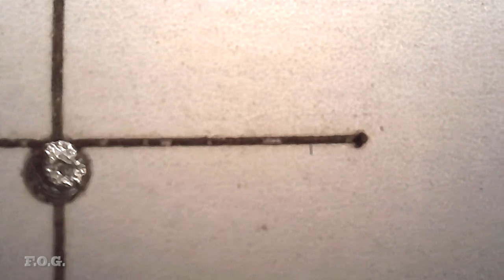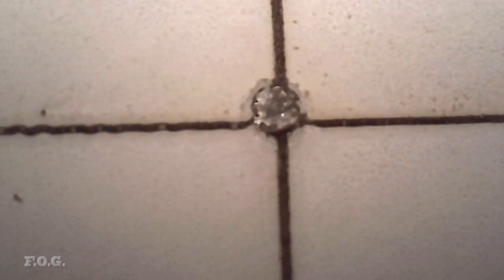So we can see a little bit of the play. It may not just be the play, it could also be that the run out of the mill is causing the holes to be in a slightly different position. But in any case, we can see that they're all pretty much consistently in a similar sort of position. After the first alignment, I'd got it to look somewhat like this, and the holes are a little bit ugly there. A little bit above, still pretty centered, but not perfect.